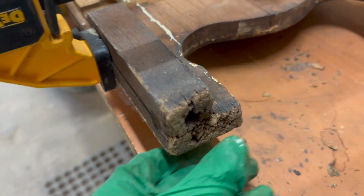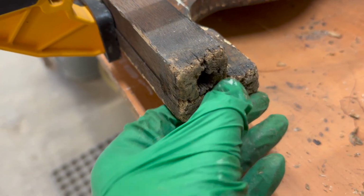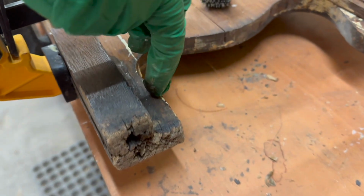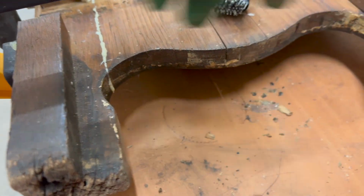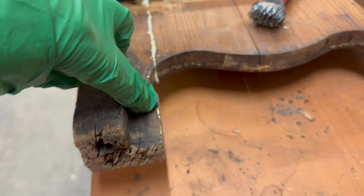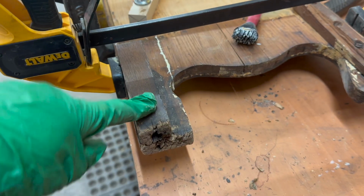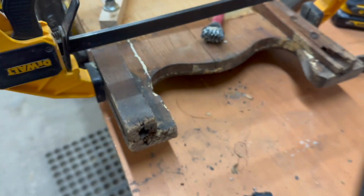of this cabinet, because this foot here is already very chewed up and in bad shape. And these pieces are starting to fall off, the carvings, and this one's missing already here. So we'll just glue another block on here and replace these actual supports for the feet.